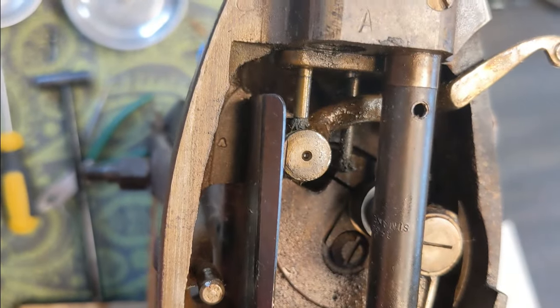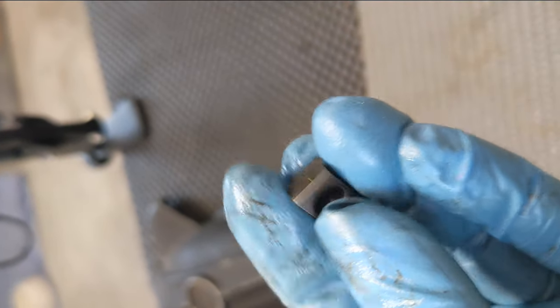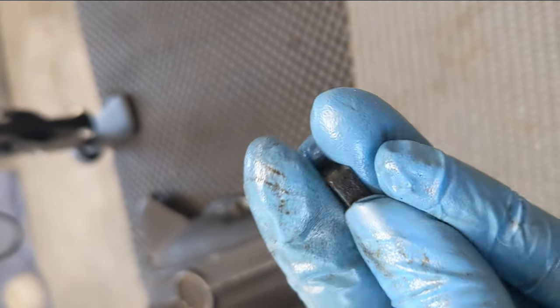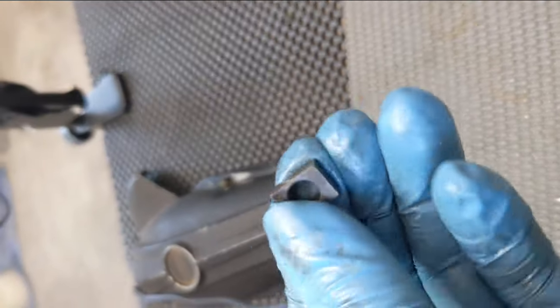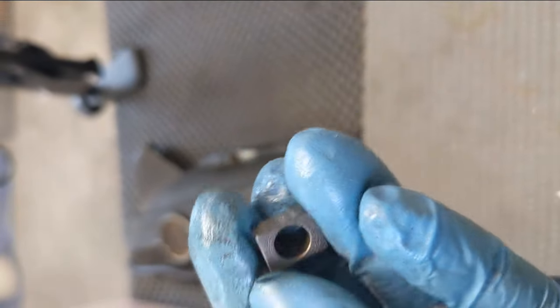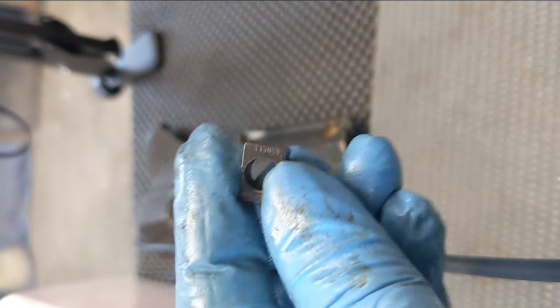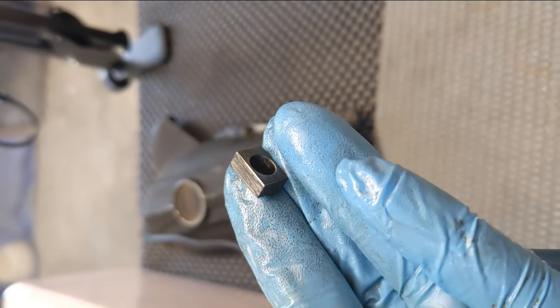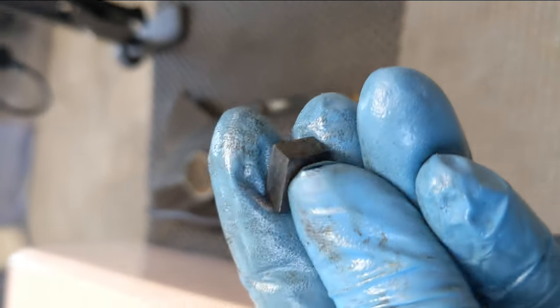Right now everything else in here I am just going to try to clean in place for a little bit and see how well I can do that. I was cleaning around in there and found this little piece floating around, which looks like some kind of a bearing type block that goes up and down in a slide. And that hole looks about the size of the needle bar. For right now I'm going to keep it with needle bar stuff. I do have a book with a part list so I can look it up and figure out where that is. It was way down at the bottom of the little cavity there.